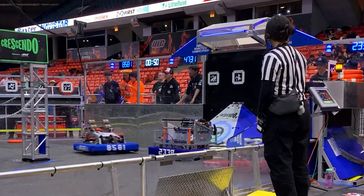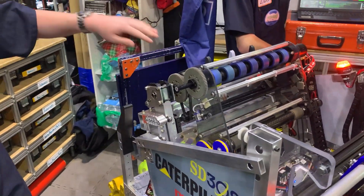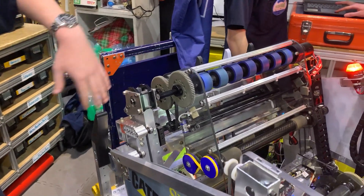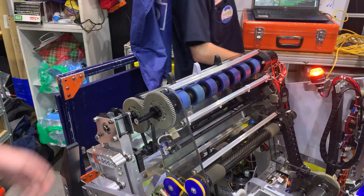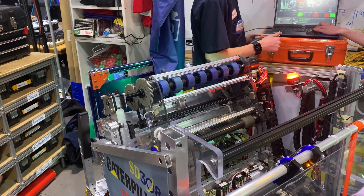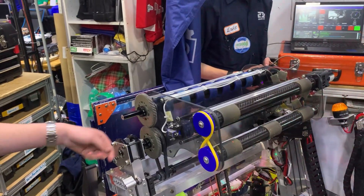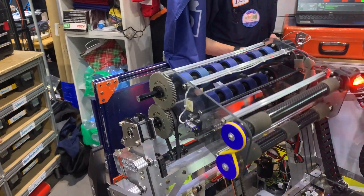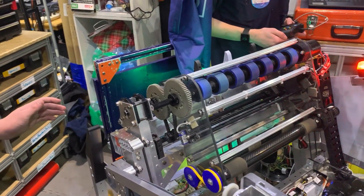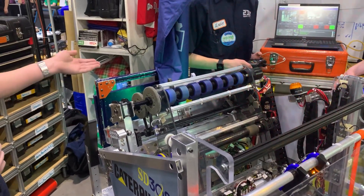This is our shooter. The whole shooter can angle itself up and down — we have 42-tooth Versa Pulleys in the back, and it pivots around the bottom roller of the shooter. That gives us a really good degree of freedom going up and down. You can see how the wrist goes up and pivots around that bottom shaft, keeping everything nice, stable, and compact. We don't need extra systems just to angle the shooter, and we found it to be really consistent with very little backlash.